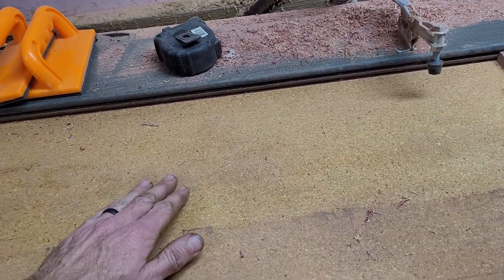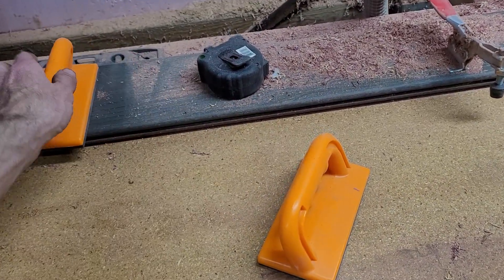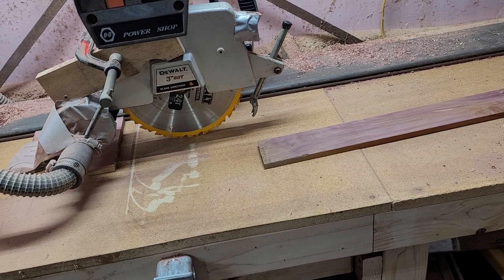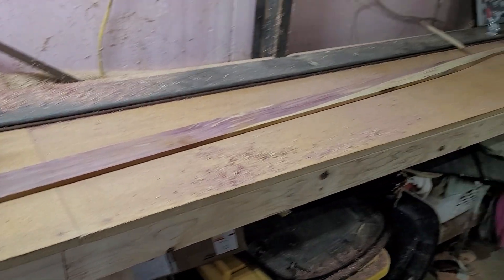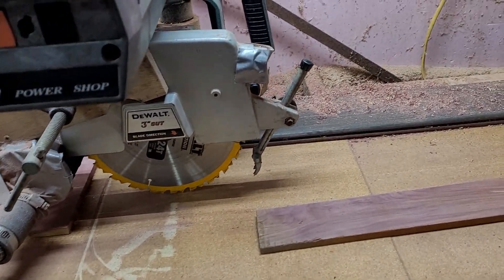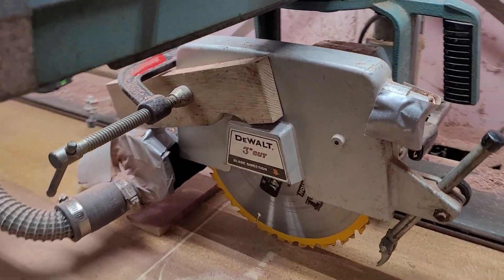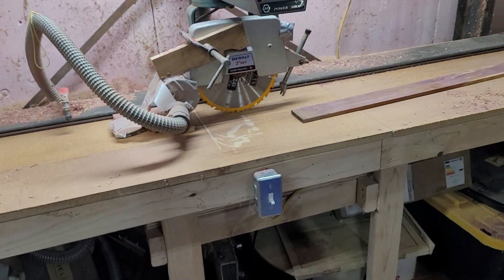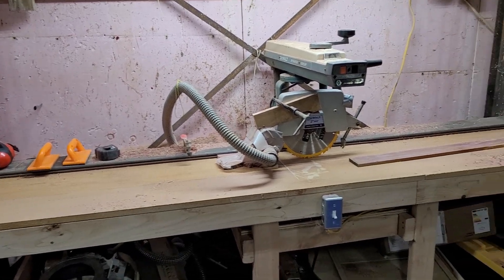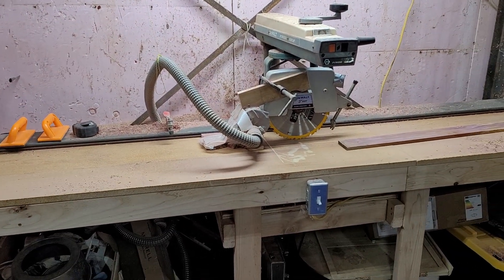I made some homemade paste wax and finished the particle board with it so boards slide a lot better. I also bought these push blocks off Amazon for like 10 bucks to help push the lumber through while I'm jointing. I've done probably 30 or 40 cedar boards lately jointing them and it works really well. I'll be showing that project later when it's done. I'm really happy with this setup and I'll be making improvements — hopefully better dust collection. Any questions, ask in the comments, like and subscribe, have a good day.